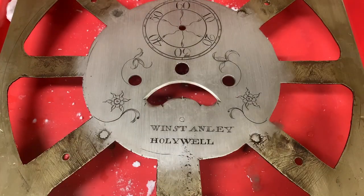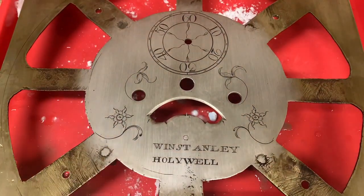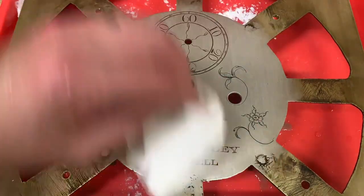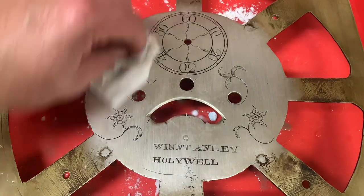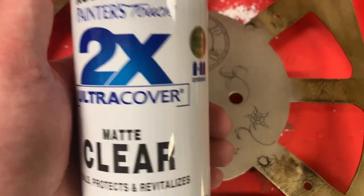We are back, and this is rinsed off. It's still wet, but I think it looks really good. I'm going to dry this off with a clean rag and put it in my drying oven to cook all the water out of it. That brings us to difference number two from the earlier video series: in that series we used Renaissance Wax as our protective coating. This time we are going to use an acrylic lacquer.